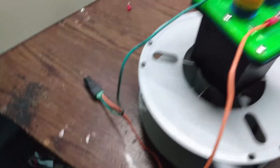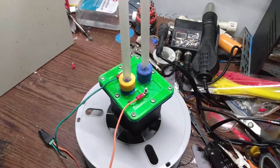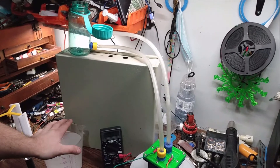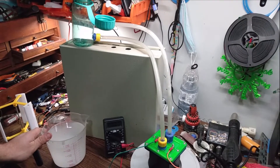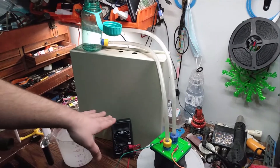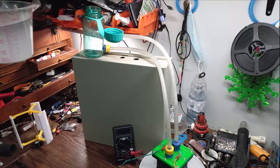All wired up — I got it set to a plug, got the tank hooked up and raised. All I've got to do is fill it up with water and plug it in to see what happens. I've got my water, amp meter, tank, and my electrolyte in the water. The power supply is on and ready to go — no water in there yet, no power flowing. As I pour the water in, the amperage should increase.